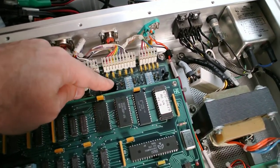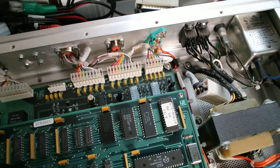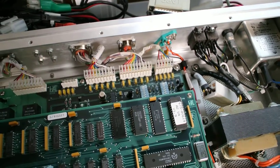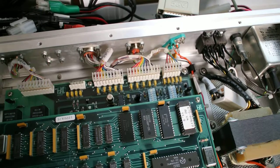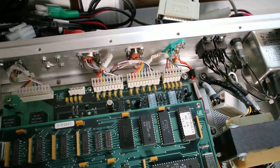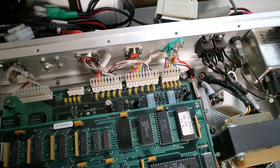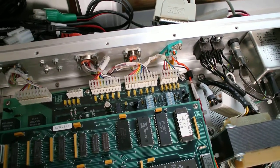The other important one here is this one — this is the tone mute. It's jumper 8. What that does is it allows the demodulator to feed audio tones back into the modulation output circuit. You need to have that on auto mute off. This will allow you to operate this in regeneration mode.